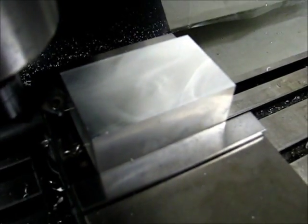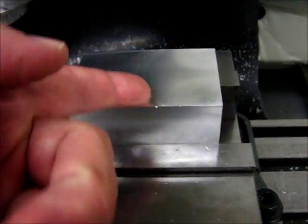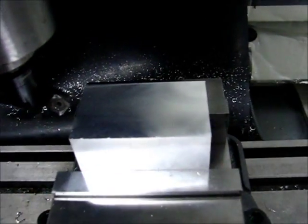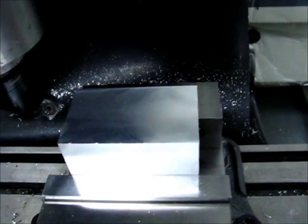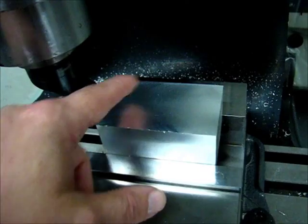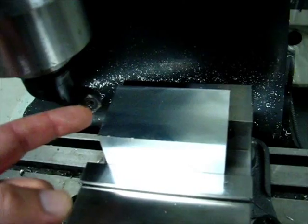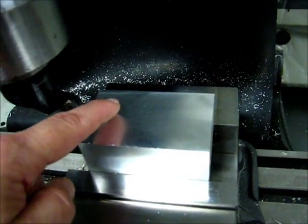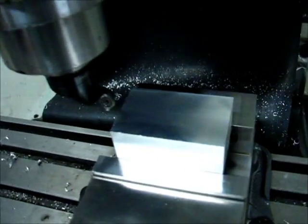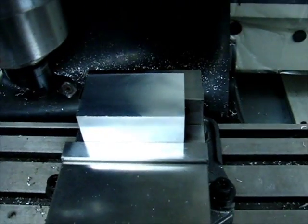Fairly difficult to make out the tool marks on there, but primarily what you see is the arcs are concave this direction. So there is some crosshatch in this area, but as soon as the cutting tool leaves off the right side of the part, I'm traveling left to right here, the crosshatch ends, and then we go to a different looking crosshatch. So I'm trying to get something that's even all the way across or closer to it.